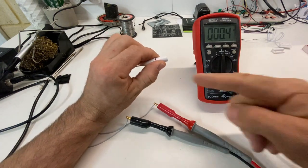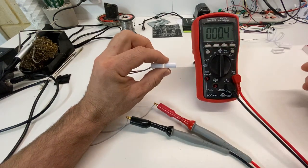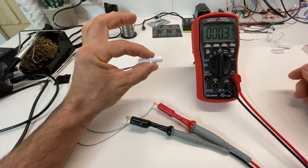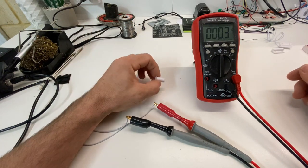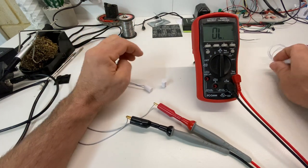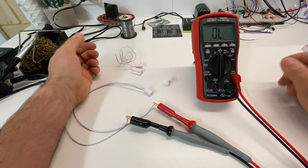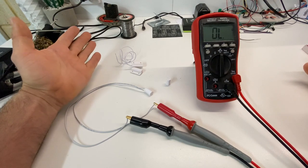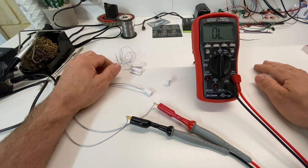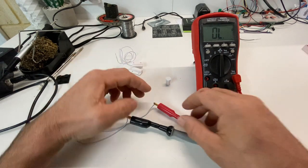Now this action enables us to do something, I guess, a little bit tricky. Sometimes you want to have a number of these sensors in a room. For instance, you might want to have a door sensor, and you might have three or four windows in the room. So you've got some window sensors and you've got a door sensor, and you don't want to have five or six sensors connected to the one room because it's just too many. So what you can do is you can actually put them in series.